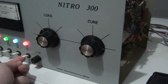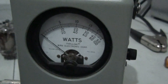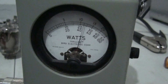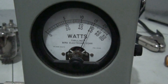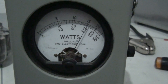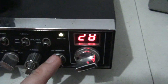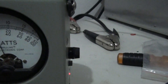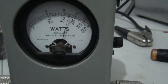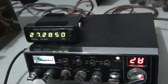Now we're going to go to high and see what it does. Carrier controls all the way down - that's about 40 watts. Doing audio tests - 600 watts. Let's turn our carrier control up - keying over 100, and that squeals back. Audio one two - you can probably hear that squeal in the background, but we're getting 600 watts output. I think I had it up close to 700 earlier - if I audio into it at a certain tone of voice it'll climb and get close to 700 watts. You can hear that squeal pretty good. With variable power all the way down it gets a lot better with less carrier going into it.